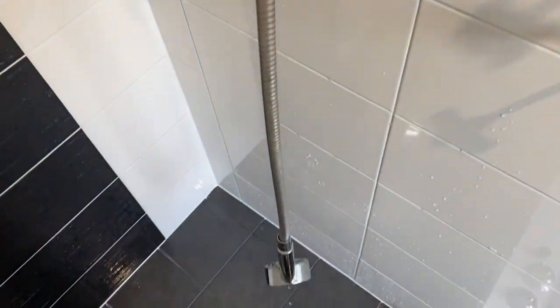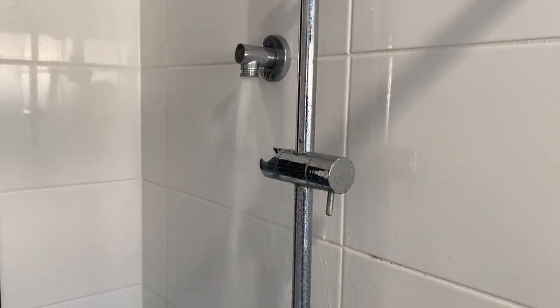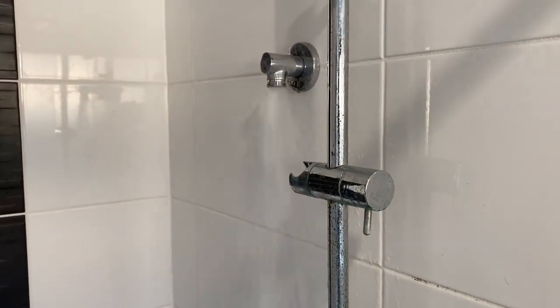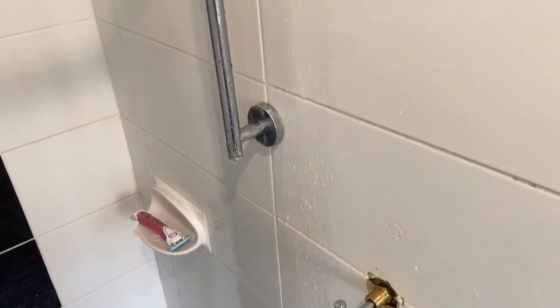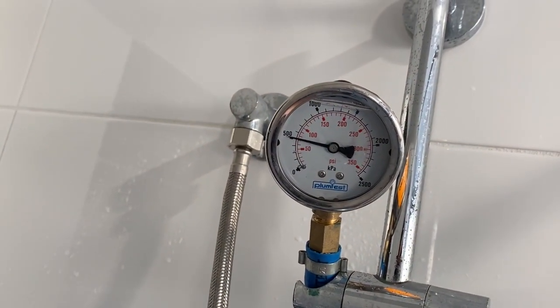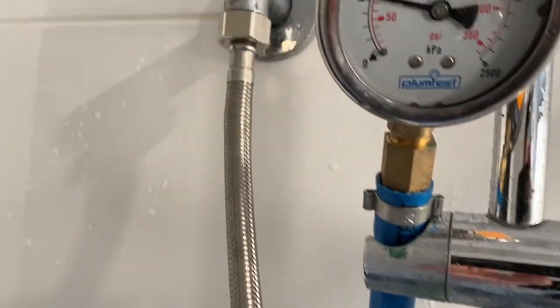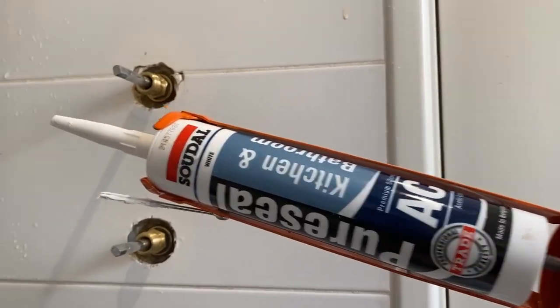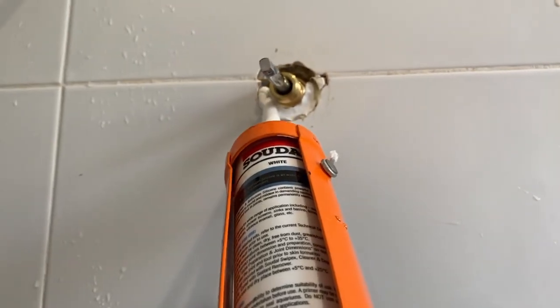Detaching the shower rose there, turning the water back on and flushing through any remaining debris, just so there are no filings stuck into the tap water itself — if there were, the shower would still drip. Both taps are off now. Running my finger across to make sure there are no more drips. Now I've attached the pressure gauge, turning on one tap to pressurise and back off, then the other. We've got full pressure through to the gauge — just over 500 kPa — and there are no more leaks. Testing that there were no leaks on the shower breach — done.